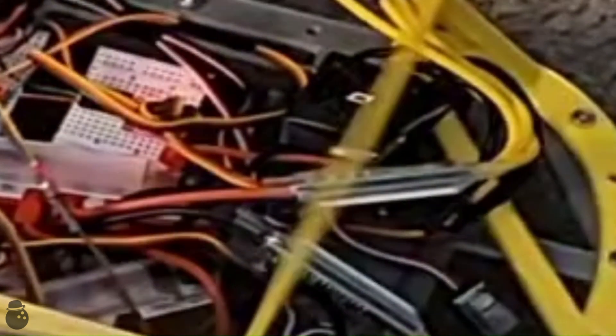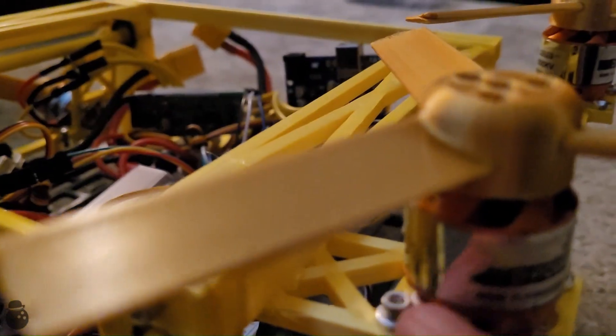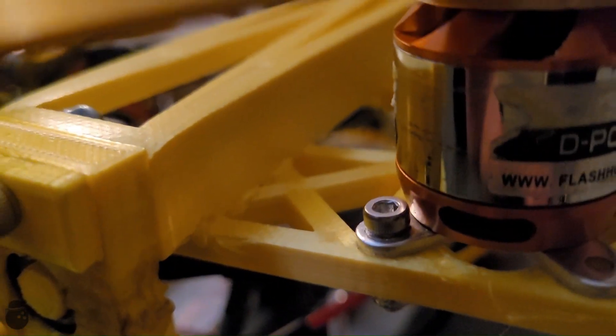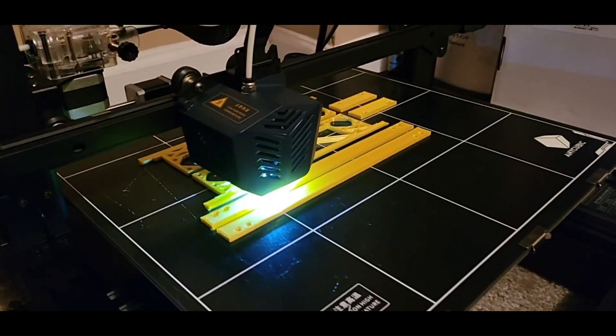Visible oscillation and structural resonance. That's not great. All the vibrations also cause the swing arm to adhere to the top cross brace. It does appear that servos aren't necessary to lift the props though, which makes this cooler and conveniently lighter. Let's make the props bigger, because we obviously need more thrust.